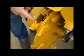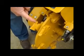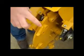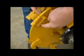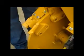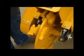Another important thing to maintain when you're checking the edge is also check the torque on the nut that holds the tooth in place — you'll find the torque spec in the maintenance manual. Along with checking the torque spec on the nuts, we also want to check the torque specs on the bolts that hold the pocket on, which can also be found in your maintenance manual.